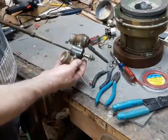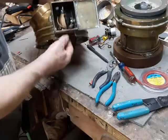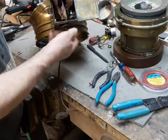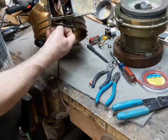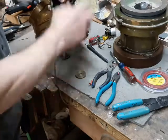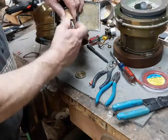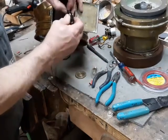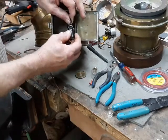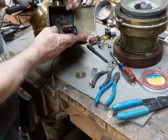I've got the cluster all put together and the wire run down through the pipe. We can turn our attention to the illumination for the compass. It looks like what we've got here is more amateur work. We have to pull this out to change the bulb, so whatever I put in here has got to be easy to remove and easy to put back in. And more amateur work — that's another reason you want tinned wires, because loose strands like that always are loose. There you go, it just fell out. This probably could have come loose the next time someone tried to change the bulb.